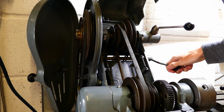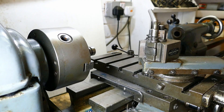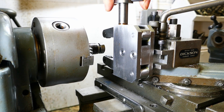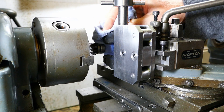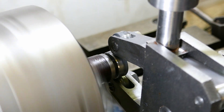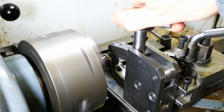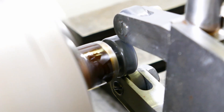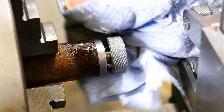For the knurling operation itself, the lathe spindle speed has to be significantly reduced. To use the knurling tool, the arms are clamped down onto the work. It sometimes helps to add a bit of lubrication — this is mainly for the wheels running on their bearings. Then the tool is passed across the work. After a first pass, the tool is clamped tighter to increase the depth of the knurls.